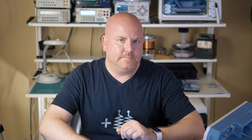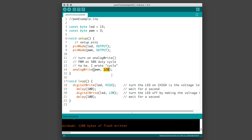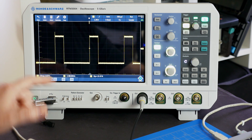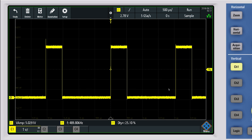Since the Duty Cycle is 50%, the signal is only on for about half the time. This is how we can control the speed of a motor or the brightness of an LED. To demonstrate, let me change the value to 64. Now we see 5 volts, 490 Hz — those two measurements are the same as before — but our Duty Cycle is 25%. So AnalogWrite is only changing the amount of time that the signal is on.